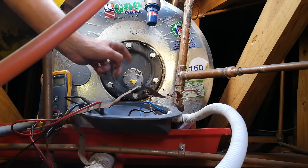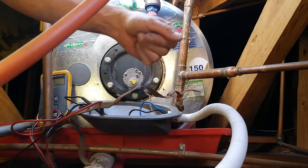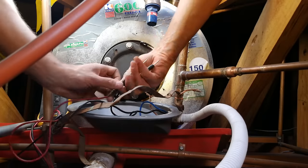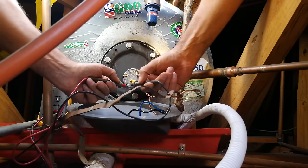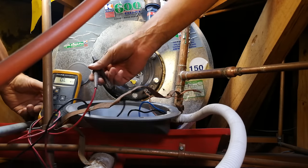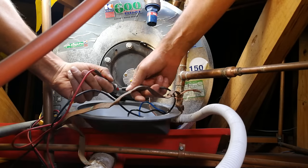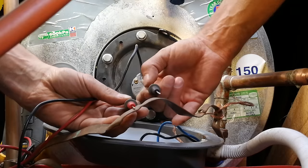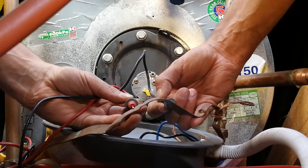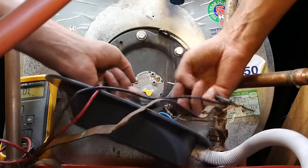I've already checked — this thermostat is working. How do you test the thermostat? That is quite easy. You would use a continuity measurement. Continuity means testing for short circuits, and when it tests for a short circuit it actually makes a noise. There we go — that's telling me short circuit. From this side to that side is a short circuit. That is why it is making that sound. Also on this part — copper to copper, short circuit.